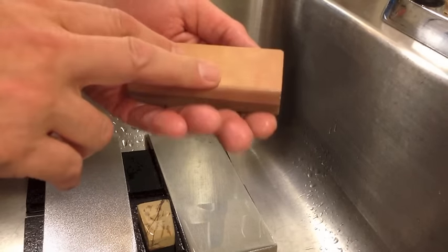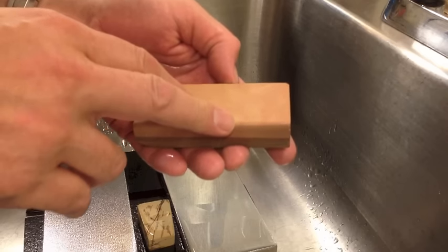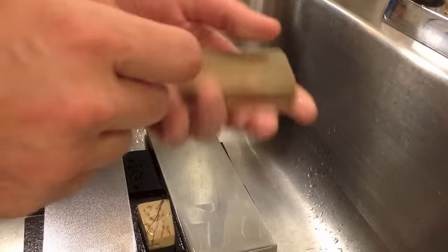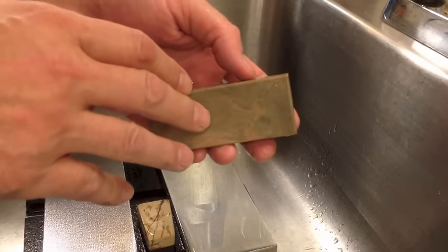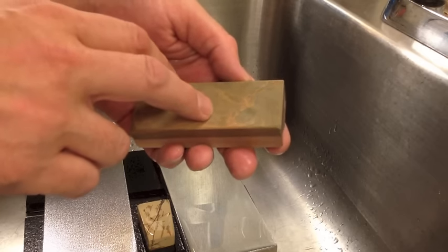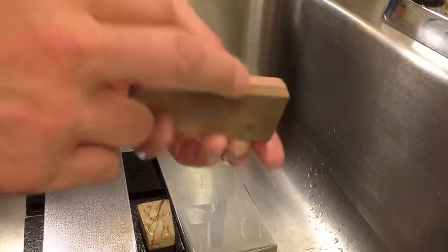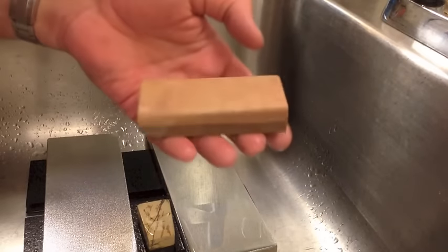On this side the abrasive is predominantly a garnet — a spessartine garnet. I think the shape is dodecahedron — imagine little tiny golf balls with flat sides that are abrasive. The other side, the hybrid, is a completely different type of material. From what I've read in Hank Bos's articles, this is chlorite and quartz, the abrasive being the quartz — very fine, markedly finer particles than the other side.